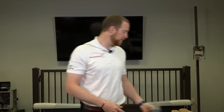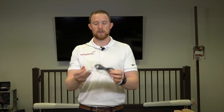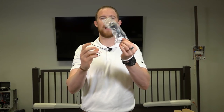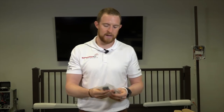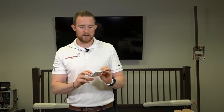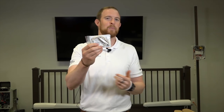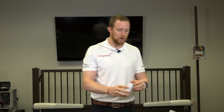You're going to get your power supply — we send the power supply with it. You're going to get an antenna, because this is a GSM-based device. This is about a five-foot lead antenna, so you'll put the Pulse Intel inside the gate operator, or up above the drop ceiling, or wherever you're going to put it. Then you can run this antenna to get the cell signal wherever you need it to go. You're going to get a door position contact — it doesn't have to be used, but you can use it to see if the cabinet's been opened or if the gate is open or closed.